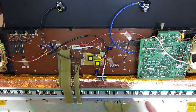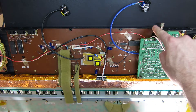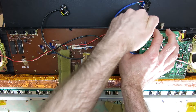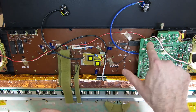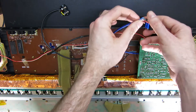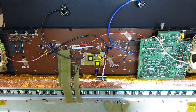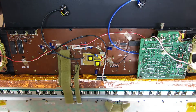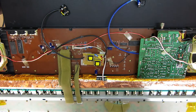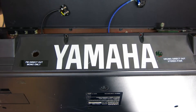These will be great for studio use. All I've got left to do is mount these into the case. I had to go with the stereo jack on the drums because where this board protrudes there isn't as much clearance — despite the case being fairly symmetrical on the back, the edge of the speaker output board is right there. So I had to move the jack quite close to the Yamaha badge, and I didn't want to drill through it, so I used a stereo jack instead of two monos. I've got a couple of 12mm holes drilled for the jack sockets in the back, and I've even labelled it up with a couple of Dymo labels, because Dymo labels make everything look way more legit.